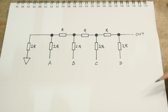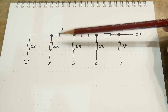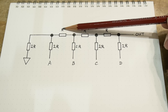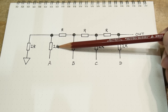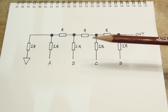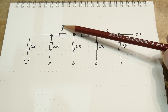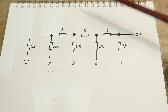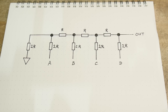We're going to talk about a bunch of resistors today. This is what's known as an R2R ladder because there's R's and there's 2R's. These values — whatever they are — are double here. So if this is a 1k resistor, this is a 2k resistor; 100k resistor, 200k resistor — it's always double. This circuit will function basically the same regardless of what value you choose. Once those values are chosen, the mathematics works out. It's just R and 2R.